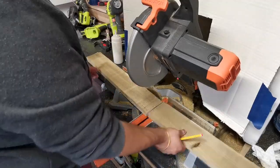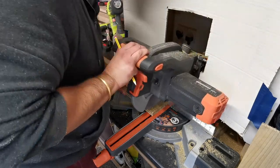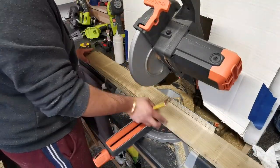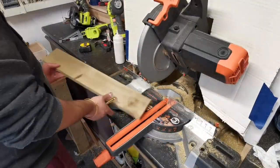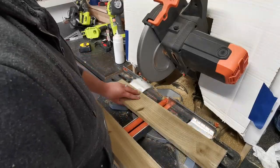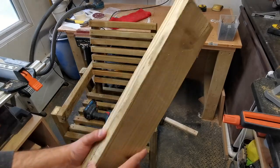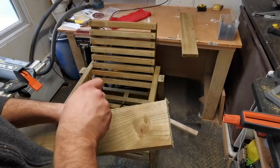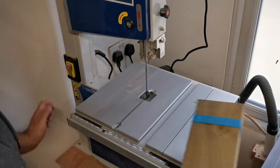Here I'm cutting a piece of 3 by 1 treated timber. The reason I'm using this particular material is because I wanted a thinner piece that is also quite wide, and these two pieces are going to be used for the armrests. I cut it to length and then I join them together using some tape, but before I do that I mark up the shape I want. I join them together so I can have an even cut for both sides instead of having to cut them individually, and I just take it over to the bandsaw to make these cuts.